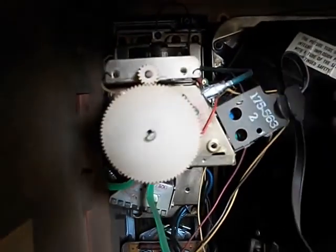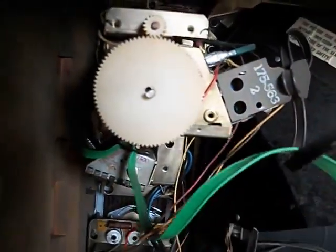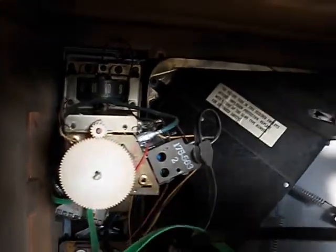Just put the tuner back in. I took the tuner out because clearly there's a bit of a space issue here — there's no reason to fight it. There's only four screws around here. I actually just loosened those and they fit over a larger hole — you let it drop down. I'm now going to be replacing the antenna pad here. I left everything connected up, you know, it just saves time. I'm going to be reconnecting wires all over the place, so everything stayed hooked up.